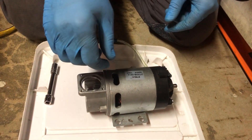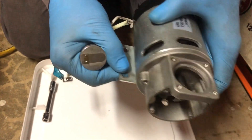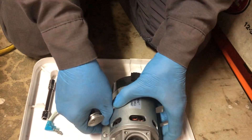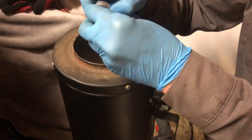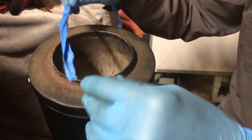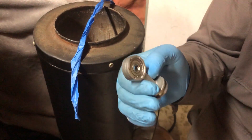The next step is installing the piston onto the shaft. I'll first freeze the entire motor assembly — put it in a bag and in the freezer for at least a couple of hours — and then heat the connecting rod in the rod oven like I showed in the previous video. It's really important that when you're heating the piston you don't exceed 220 degrees Fahrenheit or 100 degrees Celsius, because you're likely to damage the bearing if you do.